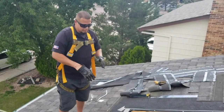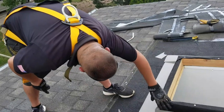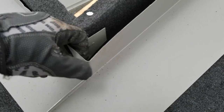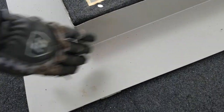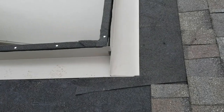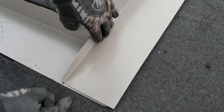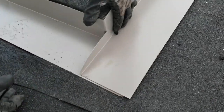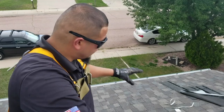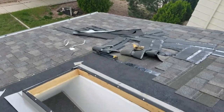You can see the flashing is all done. Again, you do it in sections — start with the bottom, cut it so it laps over onto the top, then do your sides. We're going to seal up the corner with tar before we nail it down. We also have a little rim so the water drags away and doesn't go behind. Then do the side first, fold it over, then do your top piece. We have a little channel so the water gets away and we don't get forcing water going into vulnerable areas. The flashing is done — we just need to nail this down, seal it up, install the skylight, and start putting the shingles back on.